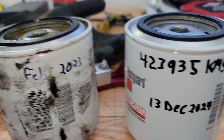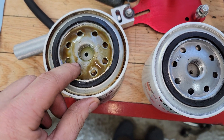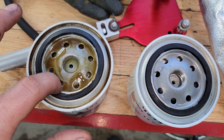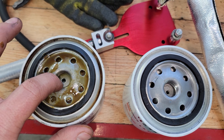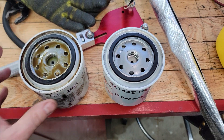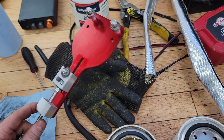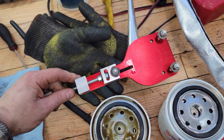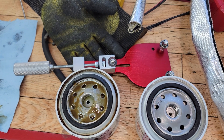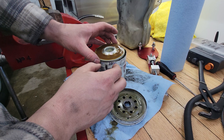There's the date — Feb 2023 — and there's today's date. You can see right away this is all gunk that was in the cooling system. The fluid flows in through here and then back out the center. You can see all the gunk — I can't wait to open this up and see what's actually inside. I'll link the filter cutting tool in the description box; it's a super useful tool to cut open filters and inspect the filter media visually to see what's clogging your system, whether it's oil, coolant, or fuel filters.